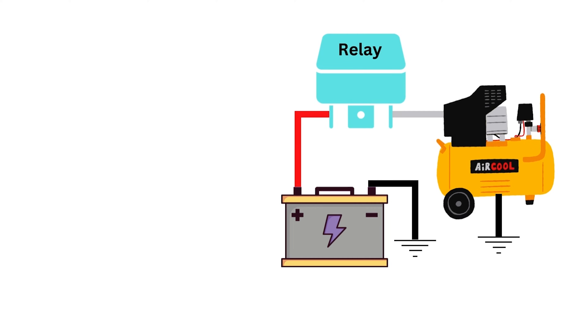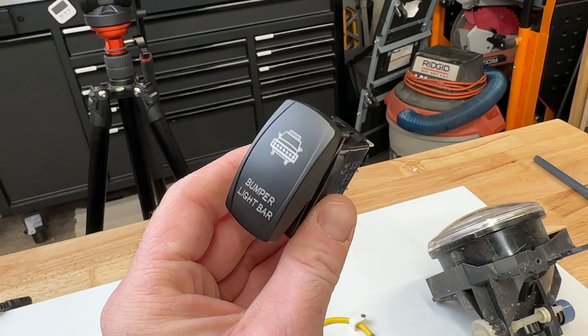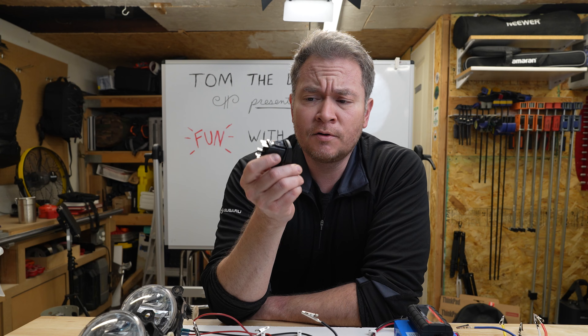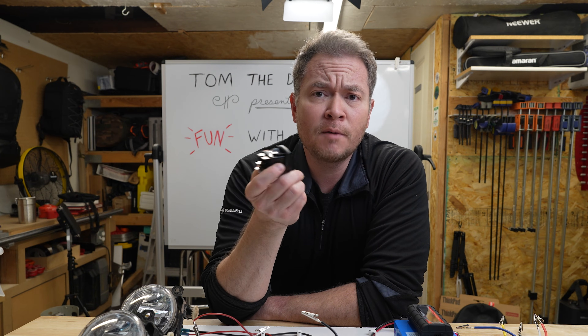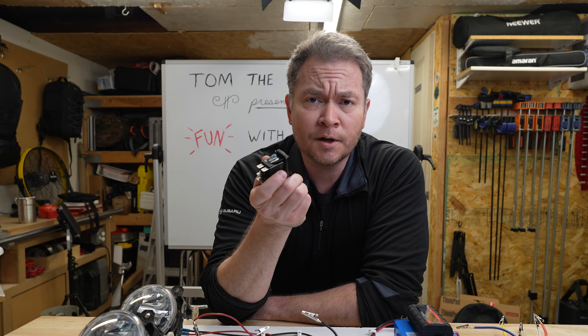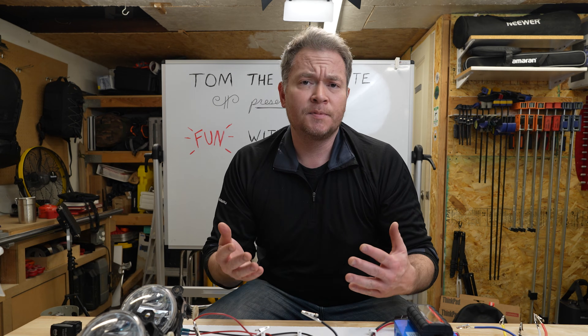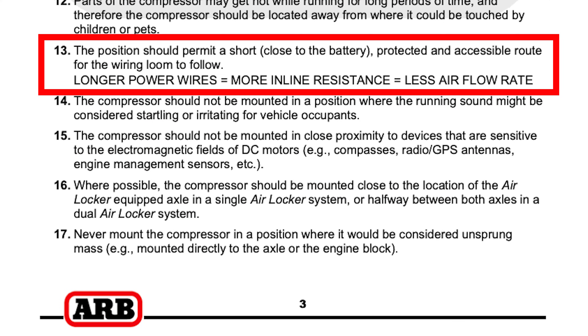This relay acts as your switch — more importantly, it's a switch capable of handling high current. Rocker switches like this one might be rated for 10 to 20 amps, but in order to use it you'd have to run an appropriately gauged wire from the battery to this switch, and then again from this switch to your component. Not only is running that much wire annoying, but the whole setup is going to be suboptimal because you're going to suffer some voltage loss over long runs of wire compared to short ones.